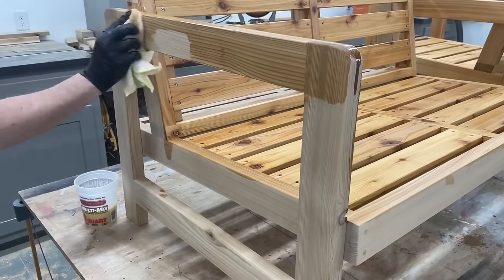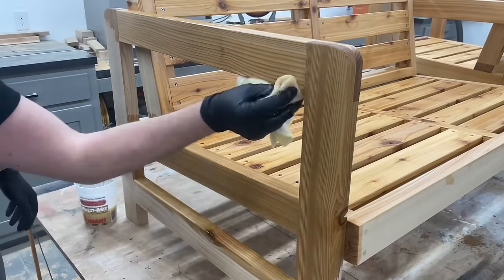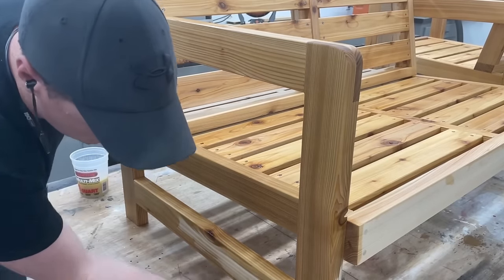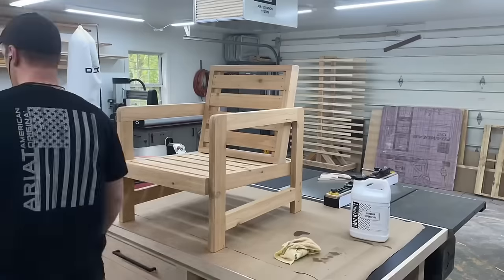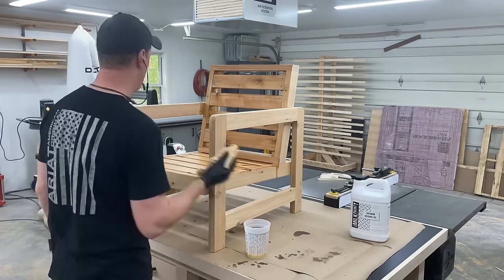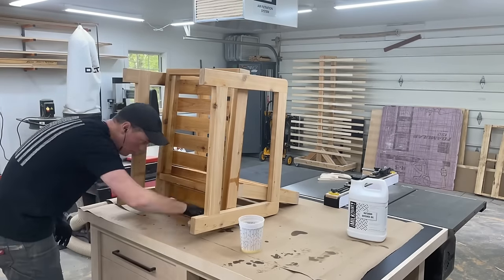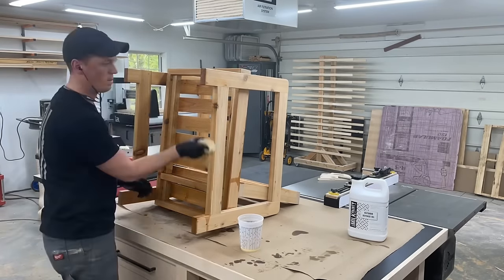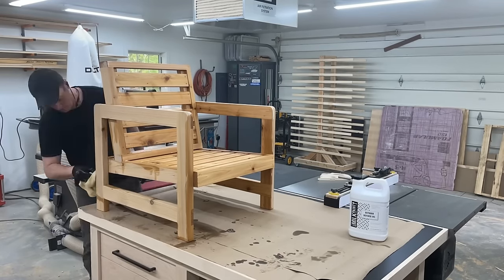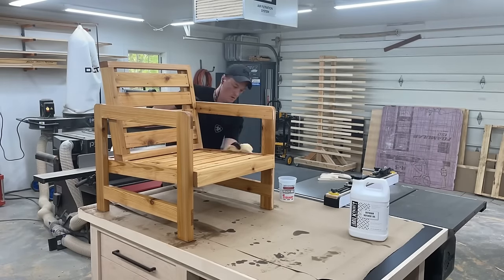With oils, in theory, I should never have to worry about needing to completely strip or sand these again. If they start looking a little thirsty or dry, I simply wipe on some more oil. And it's super fast too. So a penetrating oil will need maintained more frequently, but when it does, it's only a few minutes worth of work instead of hours. Here where I live, these will only be out on the deck for like half the year anyway, so it'll definitely last that long for our season, and I'll just plan on wiping on a fresh coat of oil every spring when I get them back out. Easy peasy. At least it sounds good.